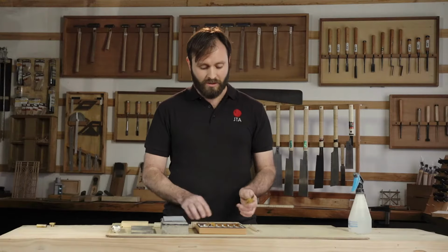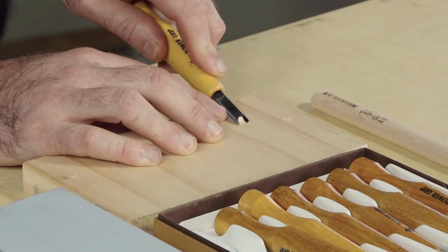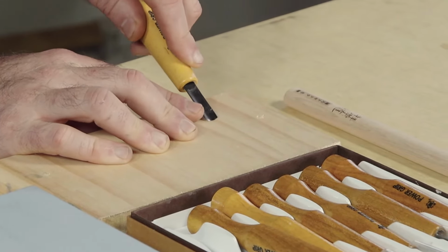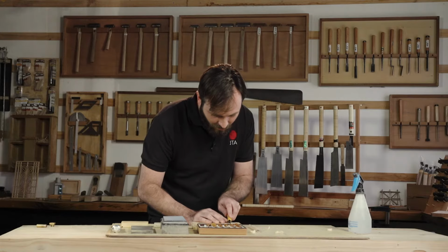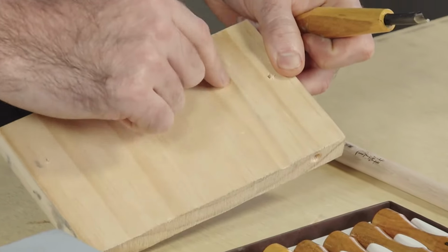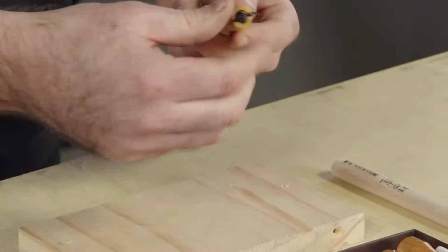What I'm going to do is put the profile of my gouge that I want to sharpen into this timber. I'm going to go with the grain and just work it in. There we go, so there's one pass. There's 2 passes. I'm just trying to knock the high points off there. So I have a profile that matches my tool quite closely, and I'm not going to need to work very hard to find the angle that I'm going to want to sharpen my gouge on.